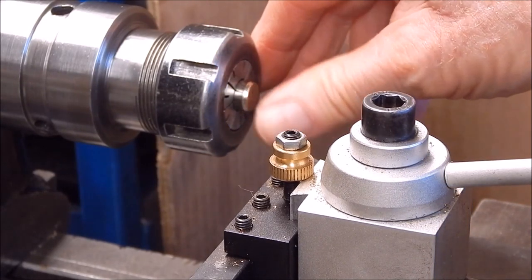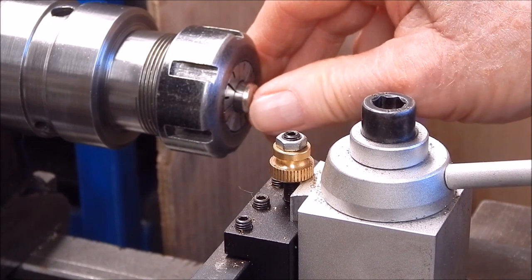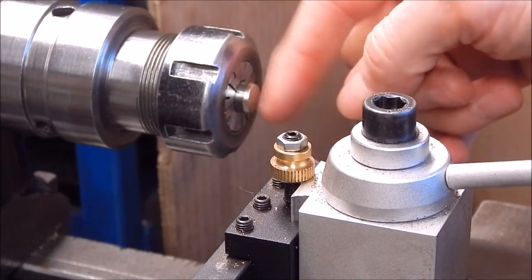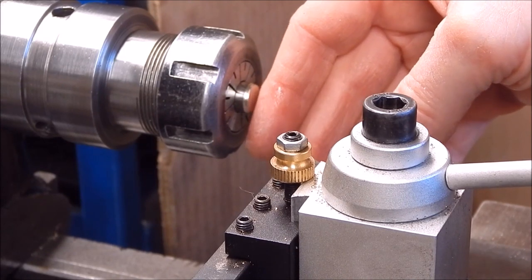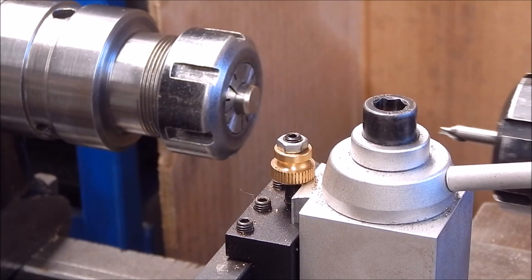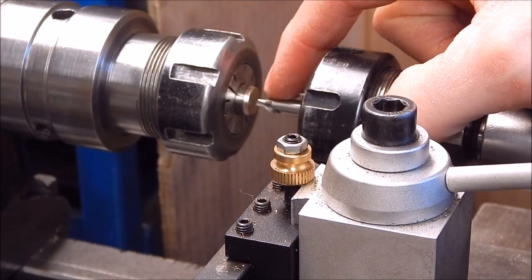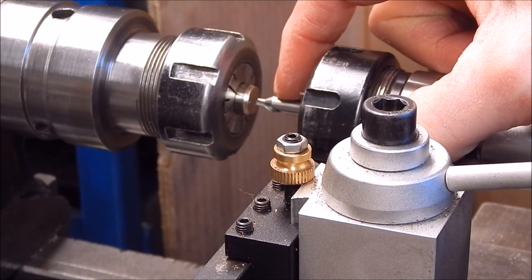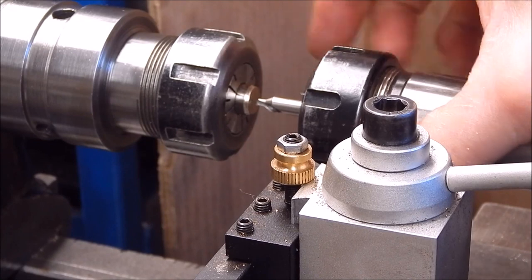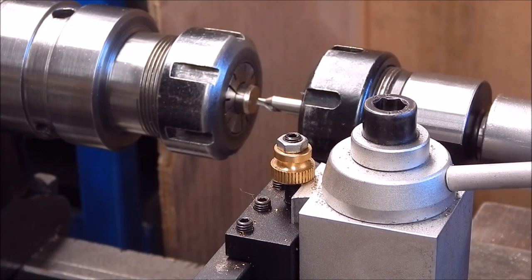Now, whenever I drill an end, whether it's faced or not, facing it is the best way to go for accuracy. In this case, it has been faced in production, and we'll leave it so we don't destroy the chrome finish. But if you were to try and just drill that with a long drill, the chances are it almost certainly will skid offline, and the drill will shoot all over the place. So you always spot the centre with a centre drill or a stub drill, and by doing that you give the proper drill a point to locate it. Even though it might be long and whippy, it won't run off, because it will find that depression and follow it right through and drill a straight hole. So always spot the ends of your jobs, and that way you've got a lot more chance of getting an accurate centred hole.